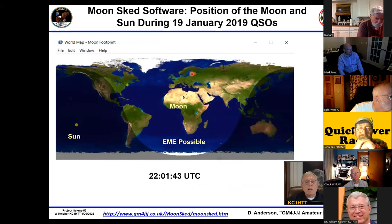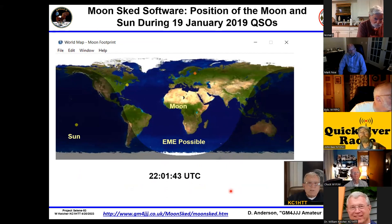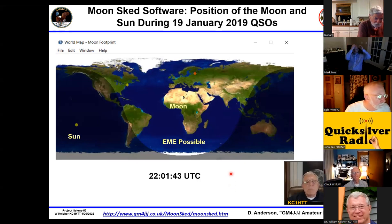Here's where the moon was — over North Africa — and here's where the Russian station was in St. Petersburg, and where we are in Connecticut. With the moon in that position, I could potentially communicate with anybody who can see the moon. The distance is roughly the same — just under a half million miles out and back. The differences come from the Earth's magnetic field, the rotation of your polarization, and who's on the air at that frequency.